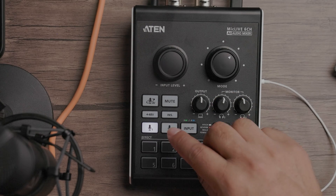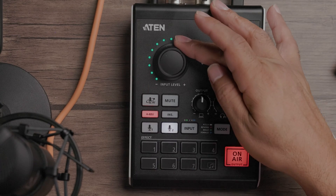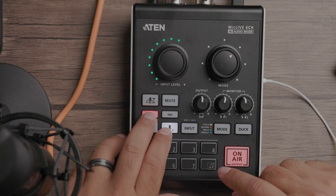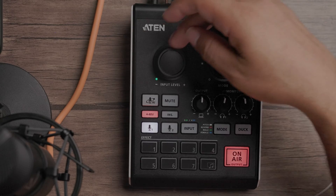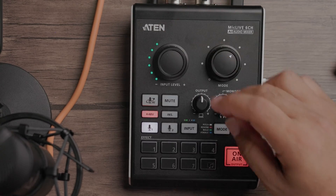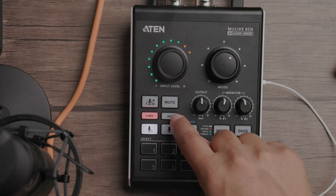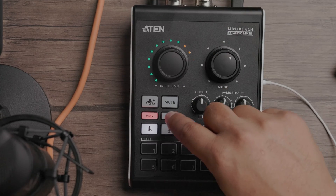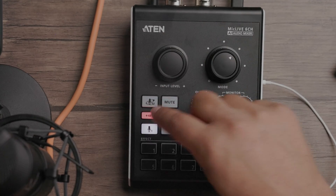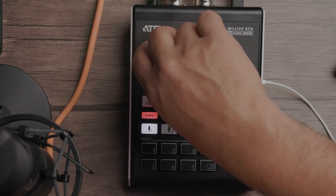Now that mic two has power, I'll turn off mic one. Right now, mic number two is my boom mic right above me — you can see the levels being played. If I want to bring the levels for mic two up, I can. And if I want to go back to mic one, I turn the other off and back on. Now I'm adjusting level for mic one, then switch over to mic two and adjust those levels again. That's so simple — that's the intuitiveness I was talking about. We also have the quarter-inch instrument ports built into the XLR ports. If you have a guitar, you can plug it in and activate the instrument input, and then the input level dial becomes your instrument level as well.